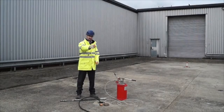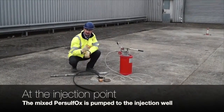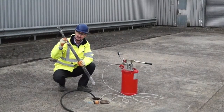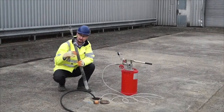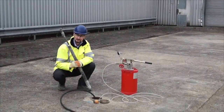The Persulfox is pumped along the hose until it gets to your injection well. Here you can connect to the well using a threaded connector, or on this site we're using an inflatable packer and stinger assembly which is lowered into the well. The packer is inflated and blocks off the annulus, and then the Persulfox is injected through the stinger into the groundwater below.